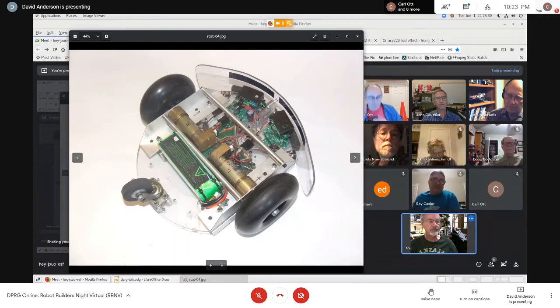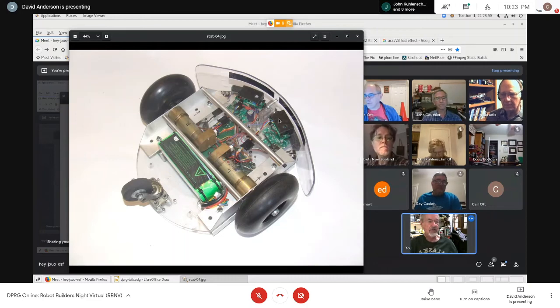This is what Doug was talking about. You could also put a piece of heat shrink over that. But in this case, one of the problems is I get these reflections off of the bumper. So this box is actually connected to the bumper, and so that light can't leak around in between. But every IR implementation I've ever done, I have to do some kind of shadowing like that. These 2 pieces of black tape on the front bumper also prevent the IR from seeing the floor.